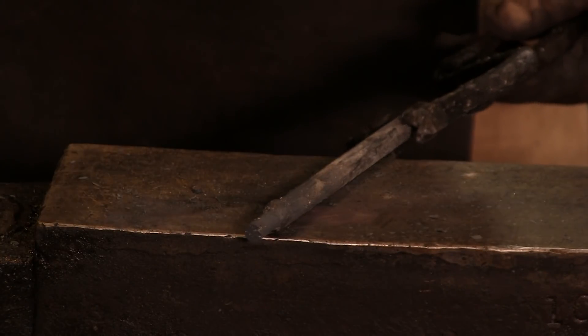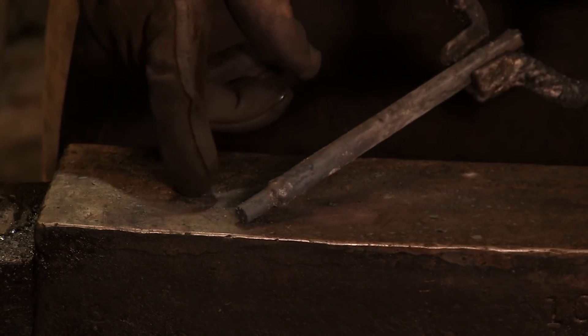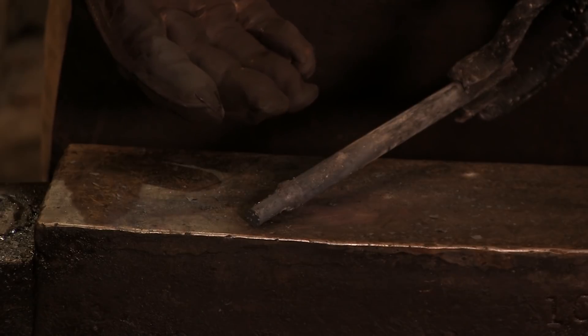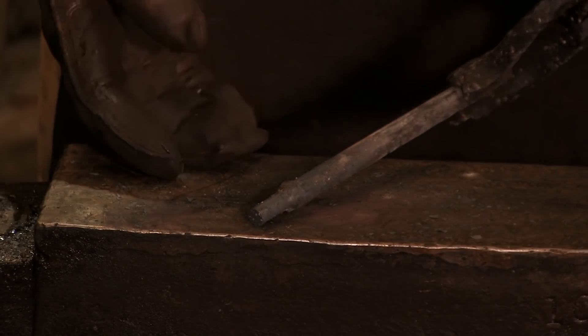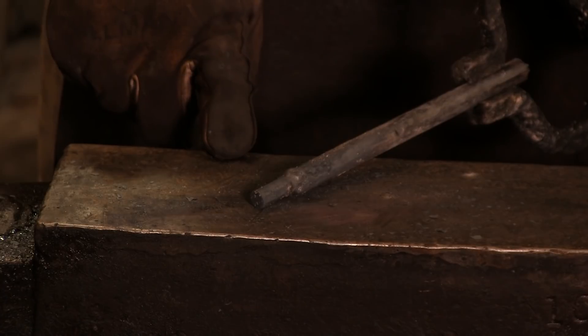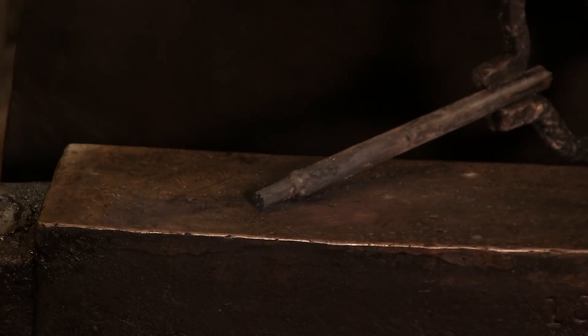This piece has just finished cooling - it's still a little warm. You can see everything's looking pretty good. You can see all this extra weld I've got on here. When you're getting ready to forge this down you can grind and clean it up if you need to - this is pretty good right here so I'm not going to worry about it. Now I'm just going to heat this up and forge this down into the same type of tip we did on our other one, except this time the tip will be made out of high speed steel.